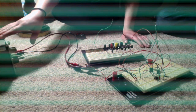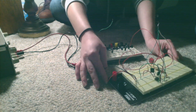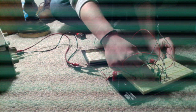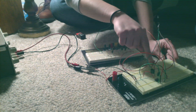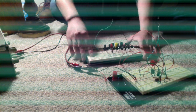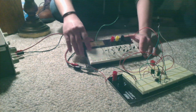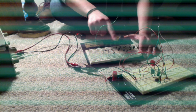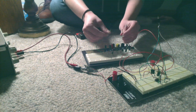So here we've got our power supply — we're using 12 volts DC. On the primary side of the circuit, we've got our 555 timer, which converts it to AC. It comes over here to our transformer, which has a gain of 14. It comes over to the secondary side of the circuit — this is where it gets interesting, super powerful! We've got all of these capacitors and diodes, and this is where it steps up the voltage a lot. We've got our outputs here, and that would be at 3,000 volts.